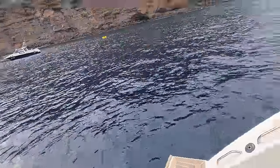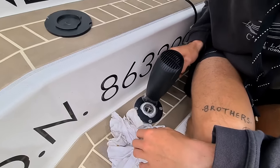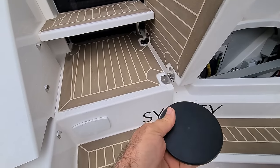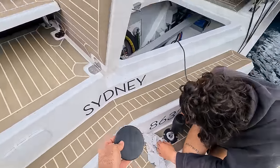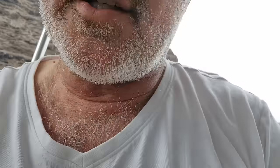One of the leaks we've been getting in the engine room is through this rudder post. A cap similar to this had come off. Fortunately the Robertson Cane guy gave us a spare cap - Garen's going to seal that on. We've just cleaned it out with fresh water, making sure it's all dry, then we're going to seal that cap on and hope it stays. The problem, as the Robertson Cane guy mentioned, is there's no way other than sealant to put it on - it doesn't screw on, doesn't have a thread, no bolt or nut to hold it. It just drops on, which is a bit of a design issue.